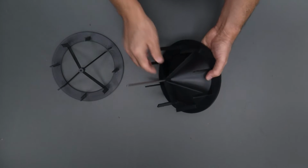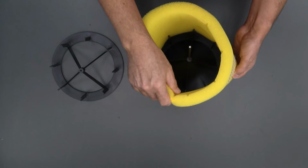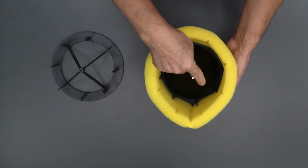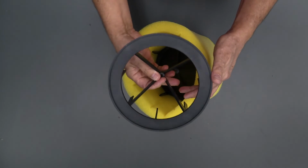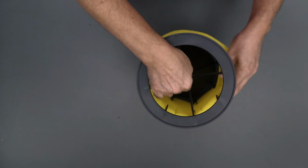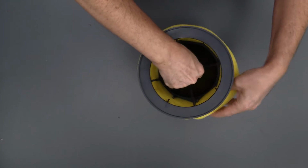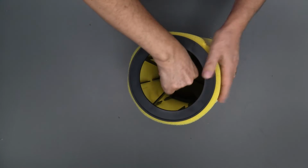All right, here we go. So let's get the new pad over here. And we're going to slide it onto the closed end first. All right, it's on there. You want to get all the fingers on the drum on the inside, as you can see. Now we'll put the open half of the drum assembly on. There we go. Slide it down the shaft, and we're going to move this pad out of the way of the fingers. All right, so it's put together.